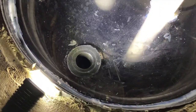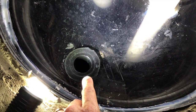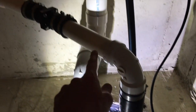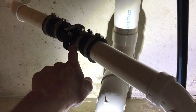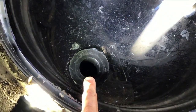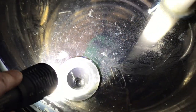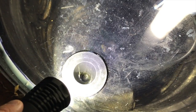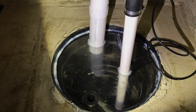There is also a safety feature here. In the event that your cap gathers water on top — whether from a leak in your sump pump fittings or check valve — any water will make its way to this hole. Once water applies pressure, that valve opens and allows water to fall down into the chamber. Once the water is gone, the valve is spring-loaded back to the closed position to maintain that airtight seal, not allowing any radon gas out of the cap.